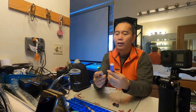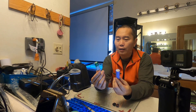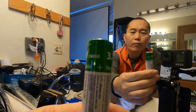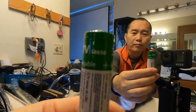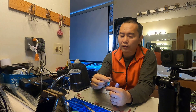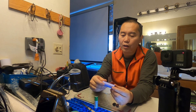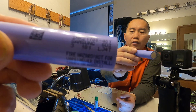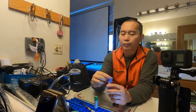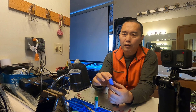Now, the battery cell you're going to choose. This is a common battery cell — the 18650. The 18 means 18mm in diameter, 65mm in height. And this is the 2170 cell — 21mm in diameter and 70mm in height, in millimeters.